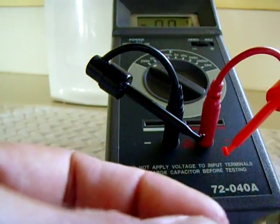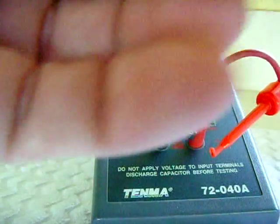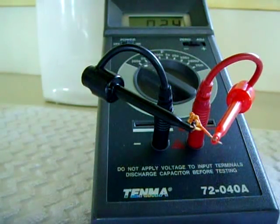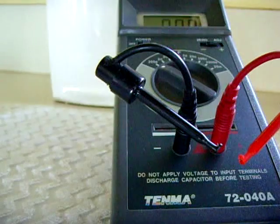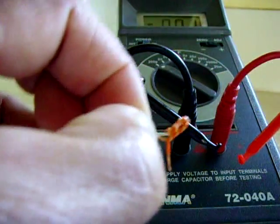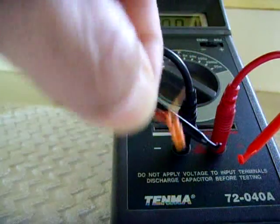The value will also probably change if I start folding it over. I'll fold it, fold it again. That is a capacitor. Let's see what the value is — pretty close to where it was before, which is fine. You're at 2.3. I notice when you start folding it over like that, it lowers it slightly. So when you make one, say you need a 10 picofarad, you make it like 11, because when you fold it, it will come down to 10. If it still shows a little high, just trim off a little bit of that wire on the end before you folded it — unfold it a little, trim off a bit, make sure the wires don't short.